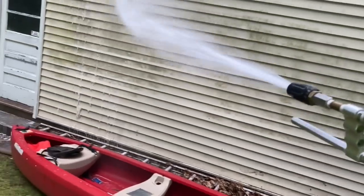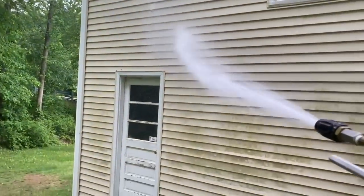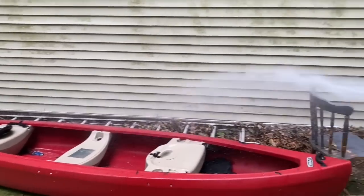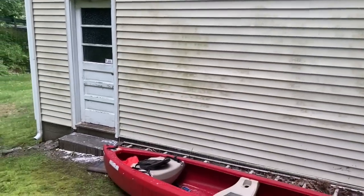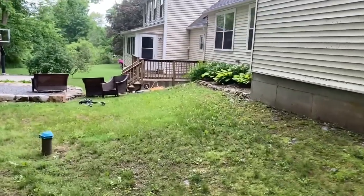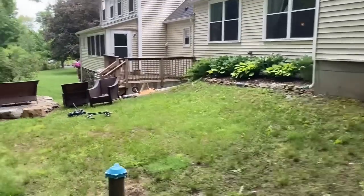I'm out here at my friend's house giving my new pistol a try — this thing is freaking awesome, it's going to get a lot of use. The new sauce is lightning fast. This surface was nasty — I should have taken a before picture. Quick visit today; I'll be using the surface cleaner on a little concrete patio out back and hit that real quick too. My surface cleaner didn't quite work the way I expected — I must have the pressure on the machine set too low. I'm going to put a pressure gauge on it tomorrow, turn the unloader up accordingly, and see if we can get it to hover. It wouldn't hover today so I was dragging it around — you could feel it wasn't spinning at the right velocity. We'll try again tomorrow.